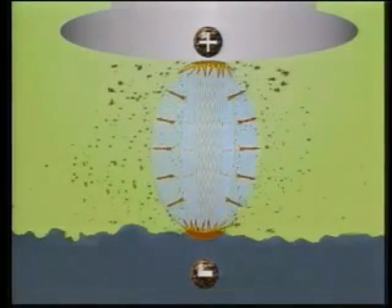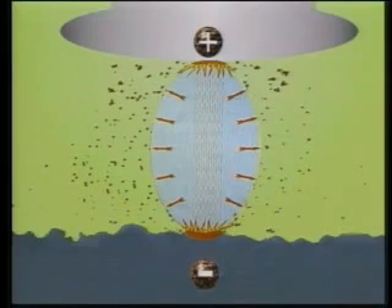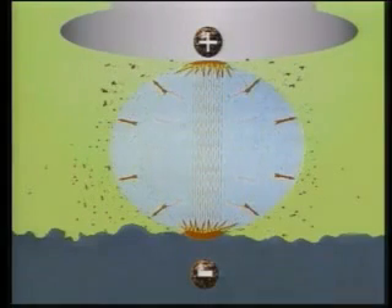At this point, both the temperature and pressure in the channel rapidly increase, generating a spark. A small amount of material melts and vaporizes from the electrode and workpiece at the points of spark contact. A bubble composed of gaseous byproducts of vaporization rapidly expands outward from the spark channel.